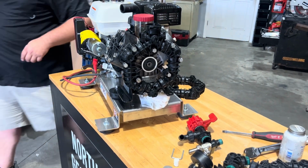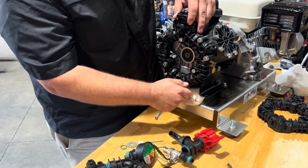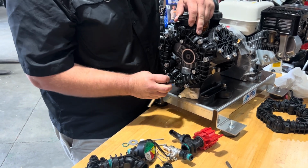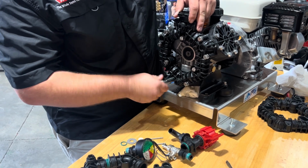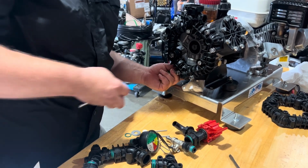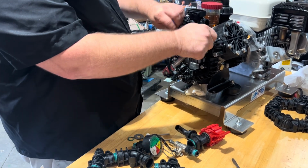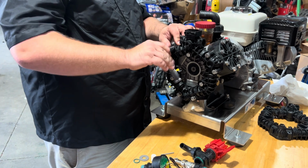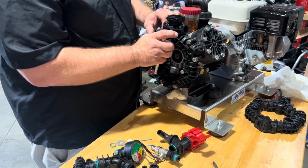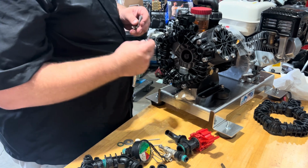Side so we get to this one just a little bit better. These are generally going to be your two most aggravating bolts out of them. Couple of others started on in. Oh, on these right here, these are going back into an aluminum casting. So these are going to be the three that I would recommend some anti-seize on.